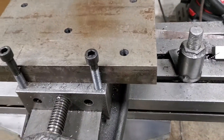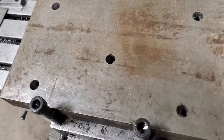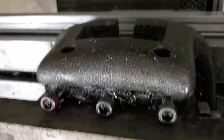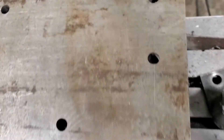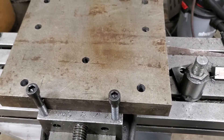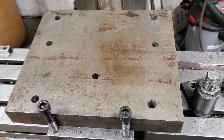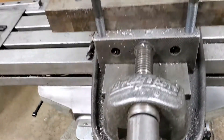We've got this one-and-a-half-inch plate clamped in there, my holes are all done, and it stays accurate. I have it clamped in fairly snug — you can't clamp it as hard as you would in the jaws of course — but there are three-eighths cap screws in the back holding it square. These holes were drilled and tapped when the vise was square on the mill table, so it stays accurate.